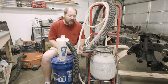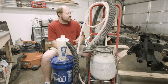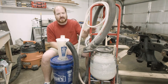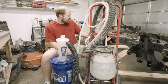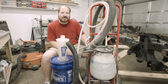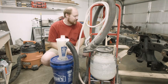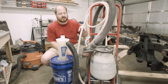I think I'll be using this a lot, though probably in very specific places. As far as working on the frame of the truck — removing the paint and all the rust — I think I'm going to be using this in tandem with other methods of paint removal. For the big, broad, long, uninterrupted areas I'll probably find a different method. But in areas where things start to get tight and I can't get a grinding wheel or a tool in there, where welds meet and I don't want to grind down on the welds, I'll definitely be using this.